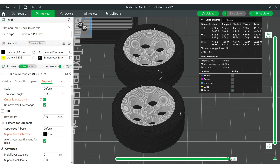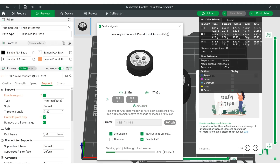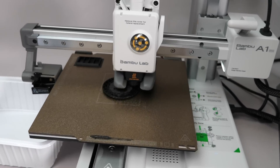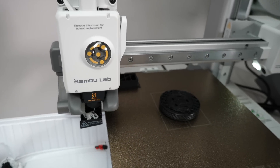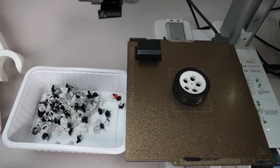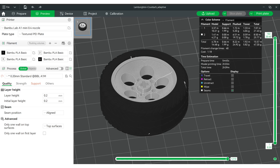Printing a single front wheel would take about 2 and a half hours with the default settings. Fun fact: if I print 2 of them, the time is only extended by about 45 minutes, because swapping the filaments layer by layer is the most time consuming part of the process. So I sent this to the A1 Mini — that's how the printing process goes, pretty fast until it's just black, and slower when the filament is changed. And that's the amount of waste this print generated. If we look at the statistics, the amount of filament used for the model and the support together is less than half the total amount needed for a single object.